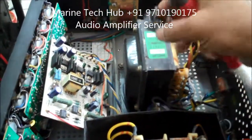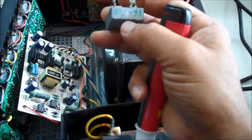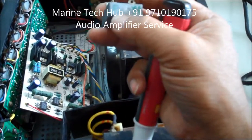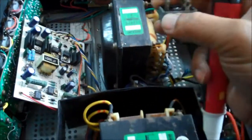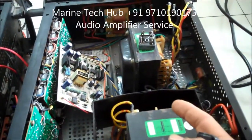You can see the markings here — I've put a mark here. This is the red and this is the yellow. You can see AC plus — connect the AC right here, and the black here. Both yellow wires should be connected here. This is one part of the defect. Once that is rectified, you will get the power.